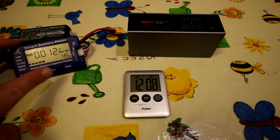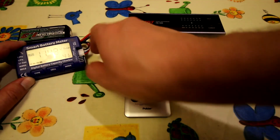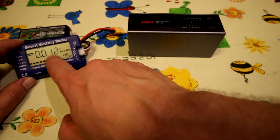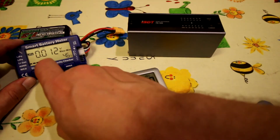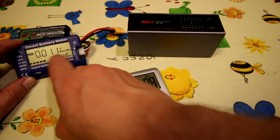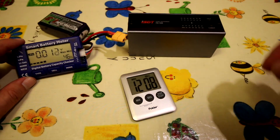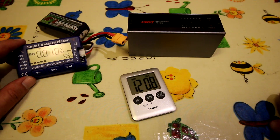I also really like to use these little battery checker tools to check after a flight how much you've used - they give a rough percentage. If you push the mode button when you first connect, you get the total pack voltage; pushing mode again cycles to a max-min setting that shows the voltage gap between the strongest and weakest cells. As a pack ages, especially under load, this is what reveals it's no longer a good pack. A gap of 0.01 volts between cells is amazing - a really good pack. Anything below 0.1 volts is fine. When a pack gets old the center cell tends to cook due to less surface cooling; putting the pack under load with this discharger will show a large gap on the max-min reading.